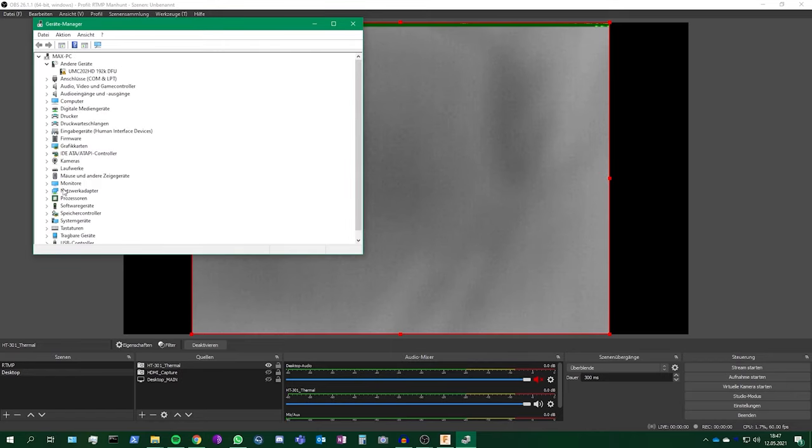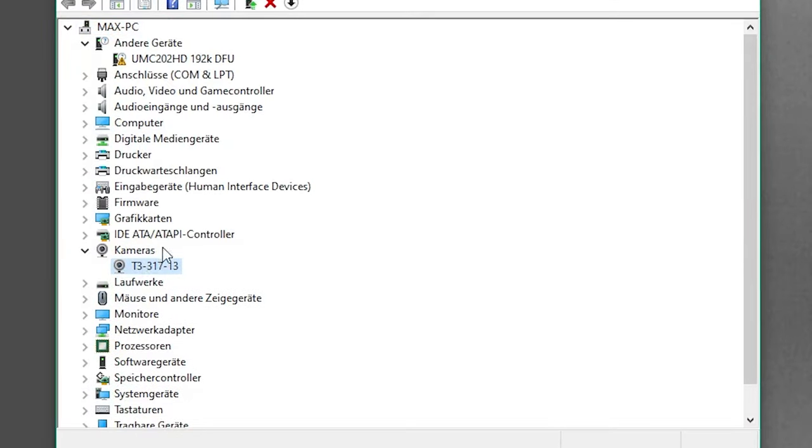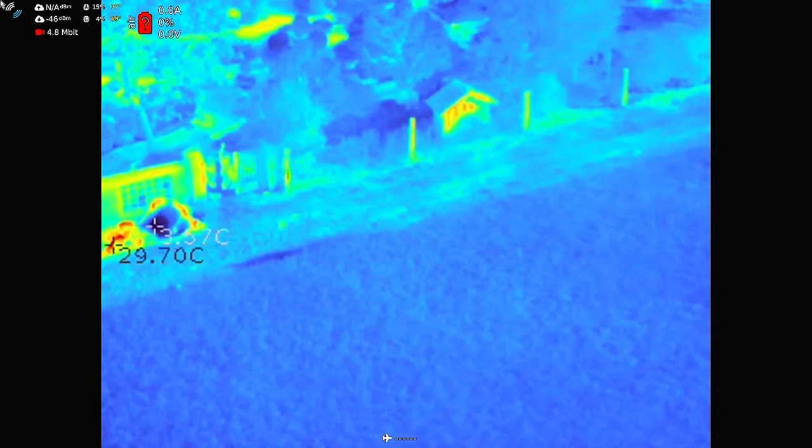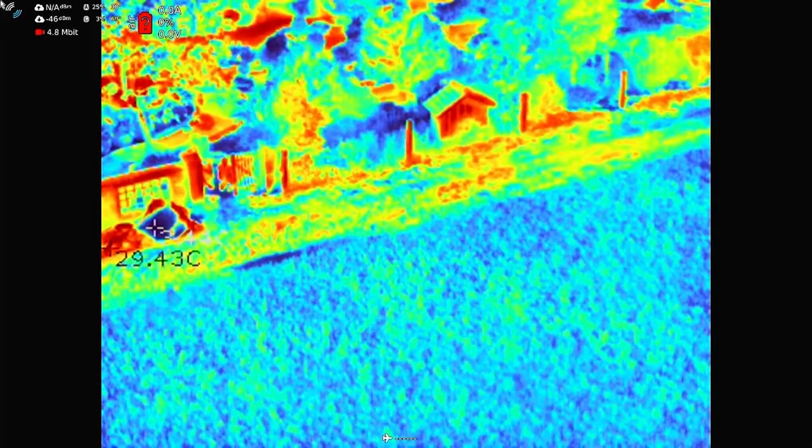This video shows a pedestrian 520 meters away. It is very likely that this thermal camera uses the same image sensor as the micro reconnaissance drone of the German military. A very cool property of this thermal camera is that it is a generic USB video device, so it is basically plug-and-play on every device and can be used directly like a webcam. The camera encodes temperature data in the bottom of the frame as pixels, which can be decoded if necessary. I have developed a driver that does exactly that. The driver decodes the temperature data and I can switch color maps and image enhancements with my controller to have more control over the thermal camera while flying.